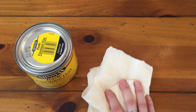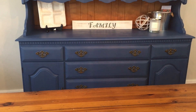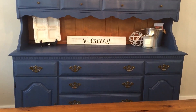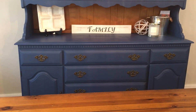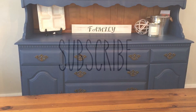I applied wax more heavily in high-use areas like the handles and the very top surface. My boyfriend wanted it to be more glossy, so one thing I'd look into for next time is polycrylic — I've never used it but I've heard not to use polyurethane because that will yellow the color over time, so polycrylic might work well for this too.